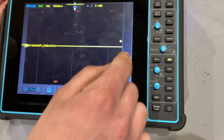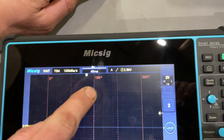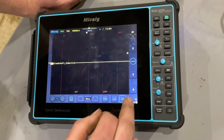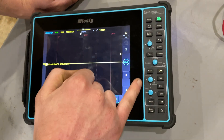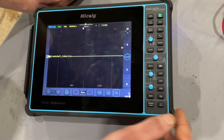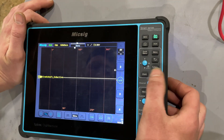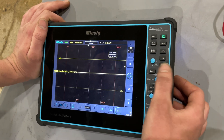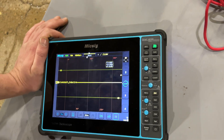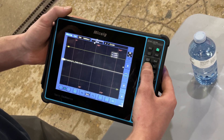There's a trigger setting, a trigger line off to the side, a vertical trigger for time, and this little T marker. This section here is your voltage scale and you've got trigger and cursor controls you can turn on. You can switch between cursors to check your voltages for fine measurements — you can move them as a set or click the joystick to move them individually.